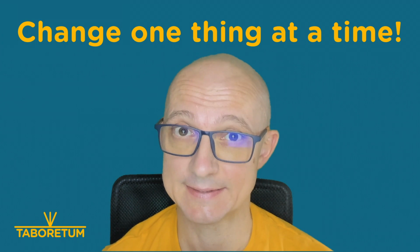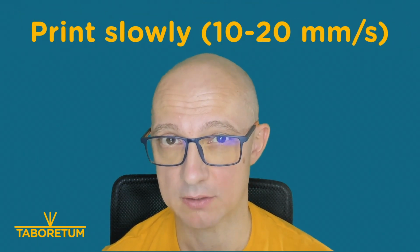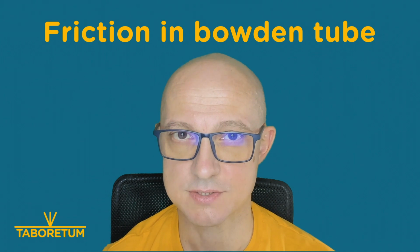Okay, time to sum it up. First and foremost, the rule of 3D printing: change one thing at a time. Second thing, print slowly, like 10-20 millimeters per second. You can always go faster once things are stable. Next, check the friction inside your Bowden tube. If it's too hard to move the filament, switch to a 2 millimeter inner diameter Bowden tube.